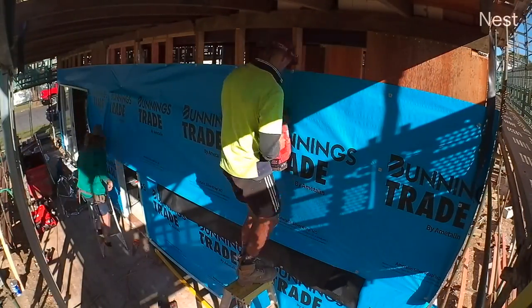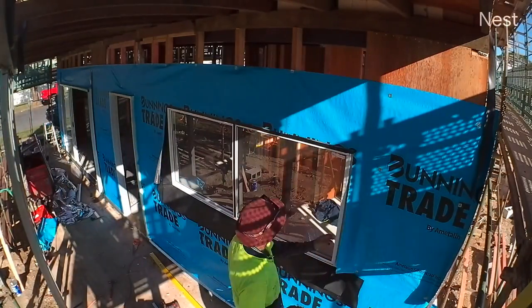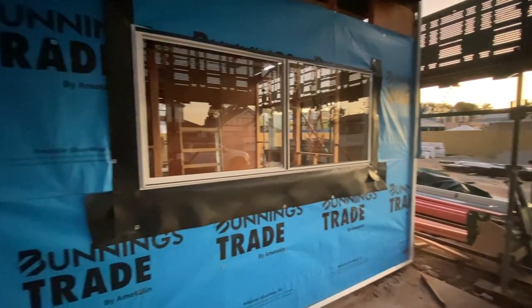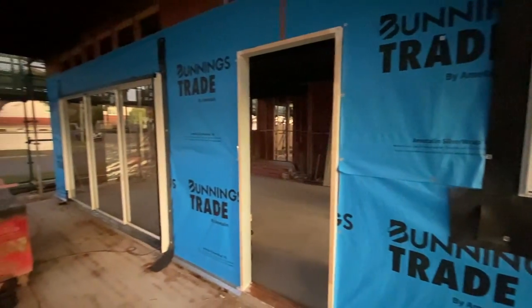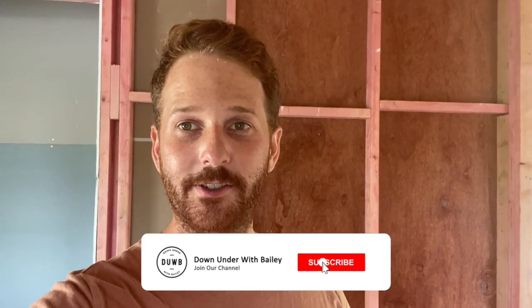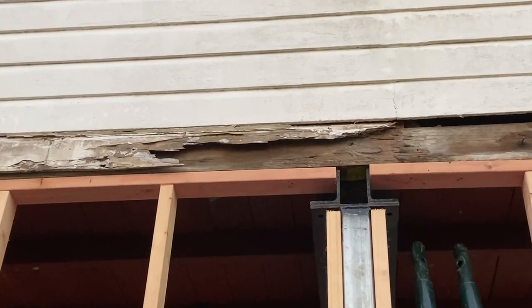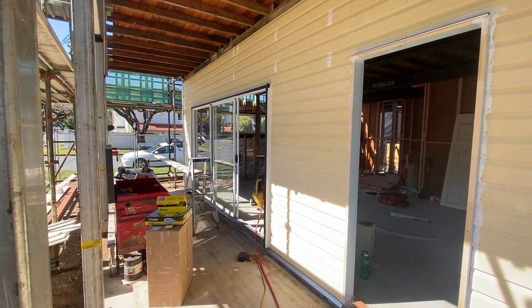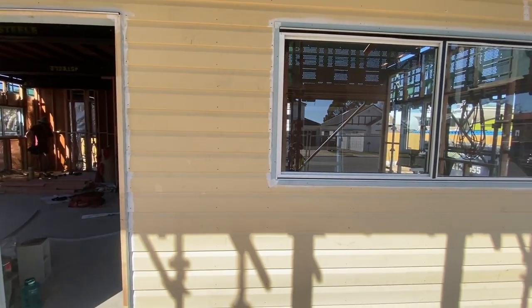For those who haven't seen this blue builders wrap that we're putting on now — because it's always pretty hidden and no one really sees it — it just acts as an extra barrier for water and rain and also helps improve insulation for the house. What we didn't expect to find was the amount of termite damage, especially even in the hardwood. This house has so much damage that the entire cladding on the outside is completely unusable, so we've had to pull down all the cladding on the entire house and reinstall it with a similar product.